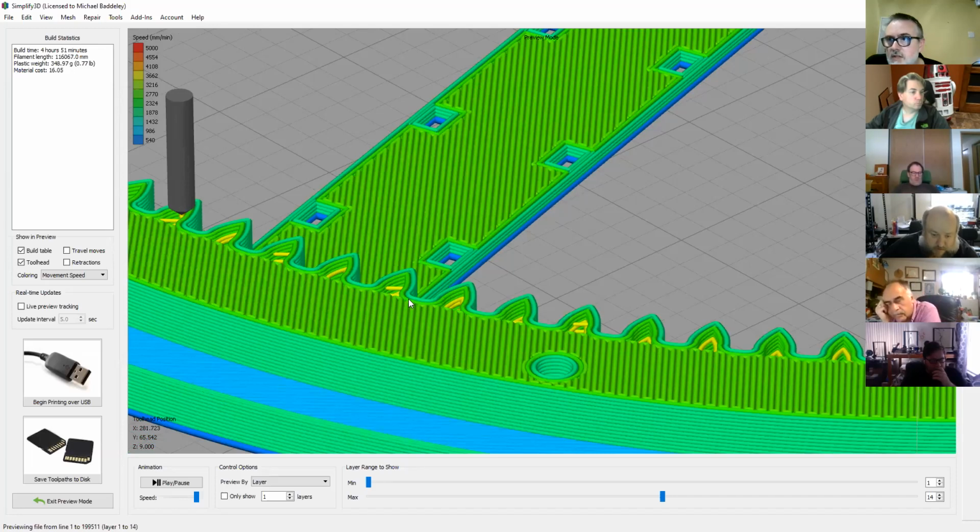The other thing is make sure there's no lifts underneath, if there's any warping at all, or if it's lifting off the print plate. What can happen is if you're not getting complete bed adherence, it lifts up, but then when it's doing the flat area it pushes against the nozzle because of the lift, and it causes a nozzle block. So sometimes layer adherence can cause that.